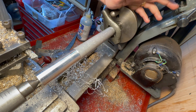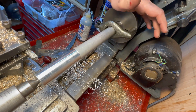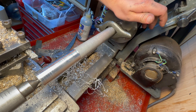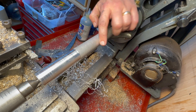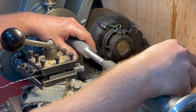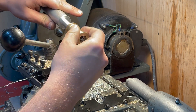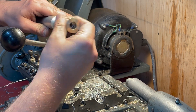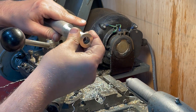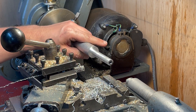I really legitimately love turning between centres — it makes me feel like a real engineer. I can totally go back to Stevenson's workshop and build locomotives in 1840, even though I clearly have no idea what I'm doing. Well, that took a very long time, but we have the mandrel with a fairly tight fit on the cylinder. I'm going to put some valve grinding paste on here and then run this back and forth, switch around, and try to polish out the scoring from the drill.